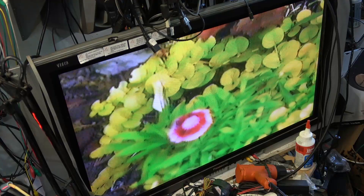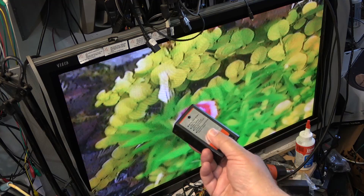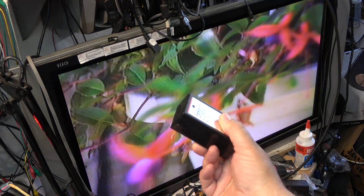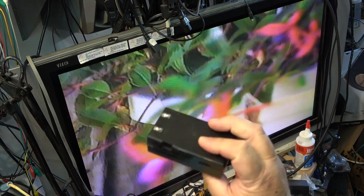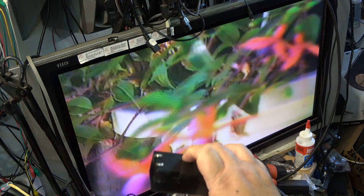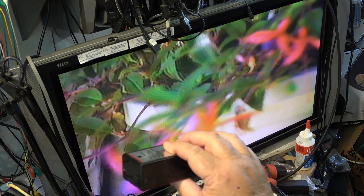Anyway, this was basically how to rebuild a battery pack. I was able to put eight sub-C sized nickel metal hydride cells into one of these NP-11s and make it work. Mission accomplished.